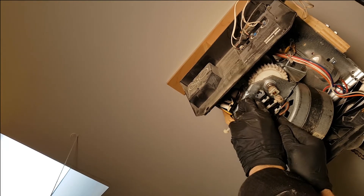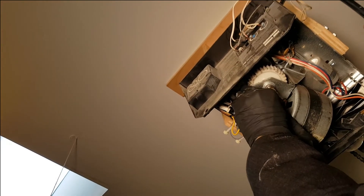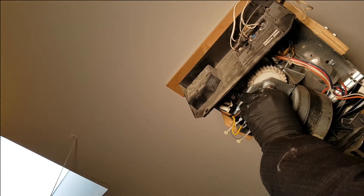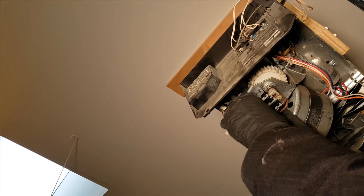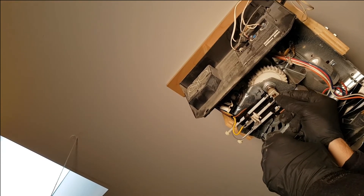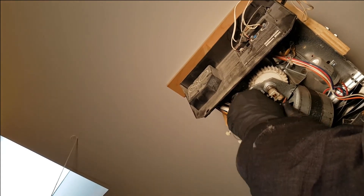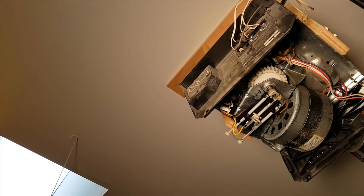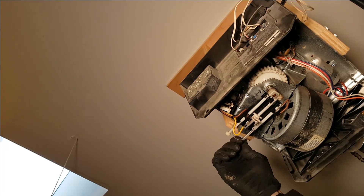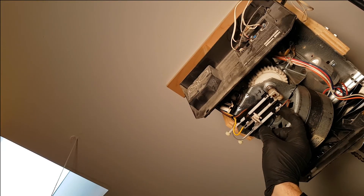You want to put the clip in the back first, and then snap in the top two pieces. And that's it. You're going to need to adjust your limits again, which are accessible even with the cover on from these two screws here. If you turn them, one adjusts the open limit and one adjusts the close limit, and it moves these two limit positions.